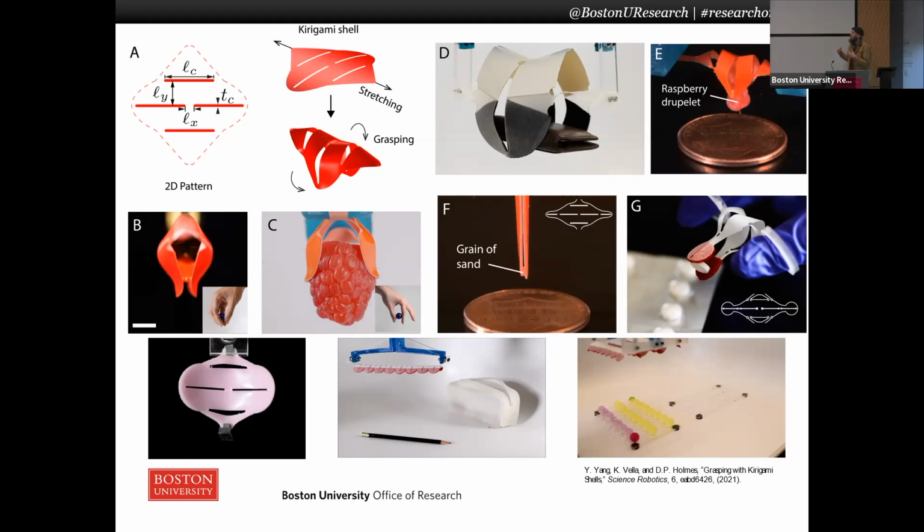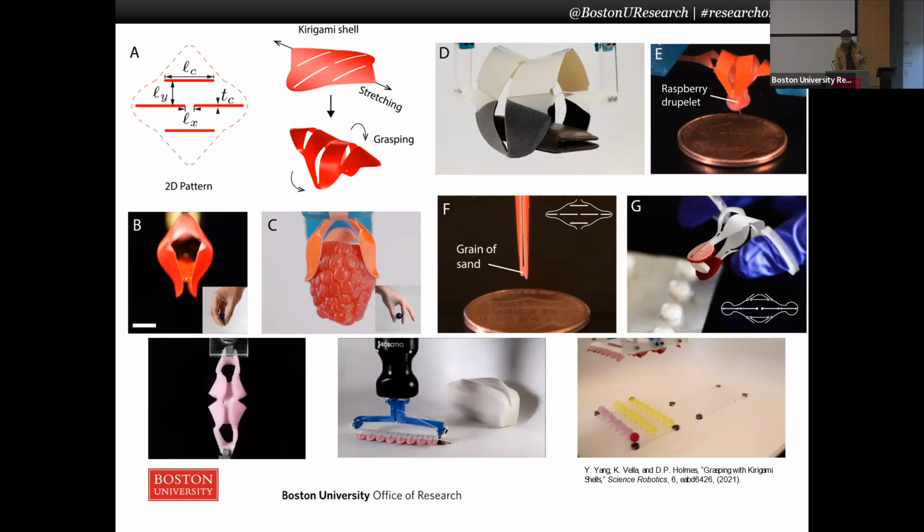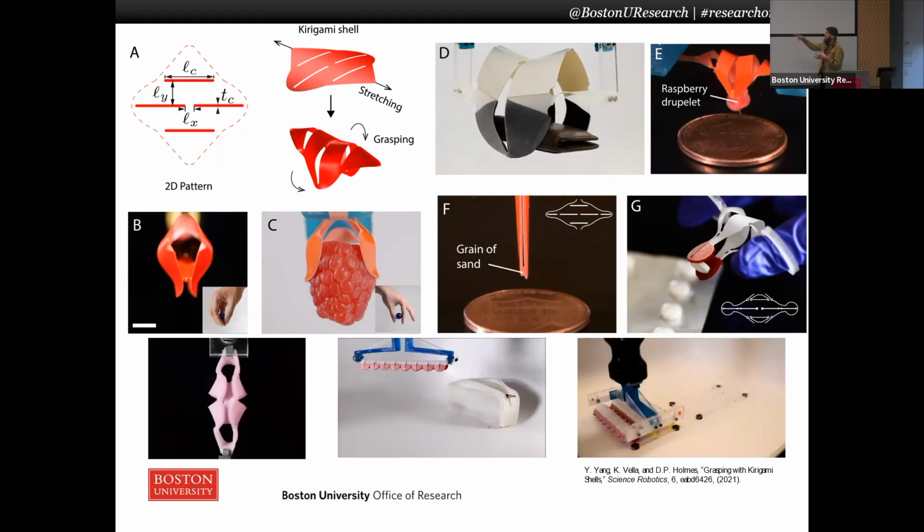And you don't have to use mechanical force to actuate them. You can use magnetic actuation. You can attach many of them in series to come down and grab something long and slender like a pencil or perhaps like Colin's hot dog. You can attach them in series and parallel to grab an array of objects and manipulate that entire array without losing how they're behaving together. So here it's gonna grab a bunch of slippery gel beads, rotate them and put them back down.